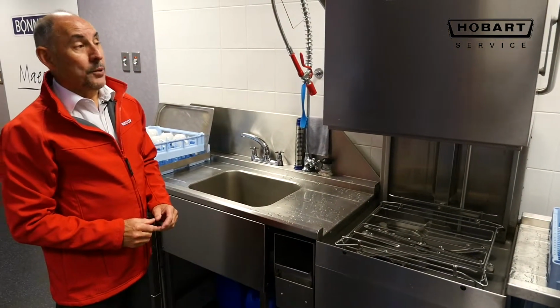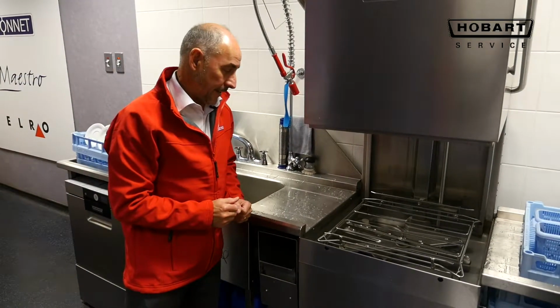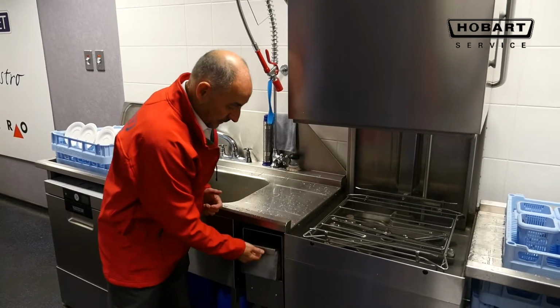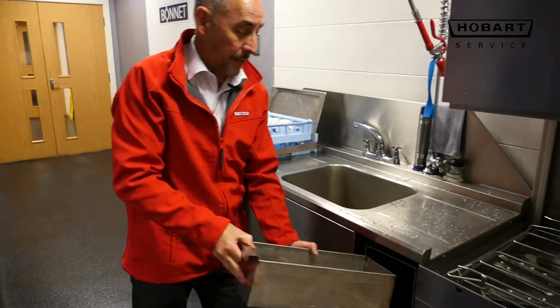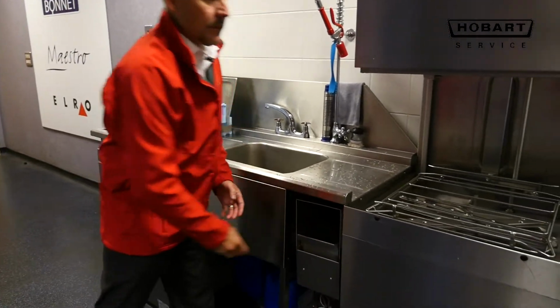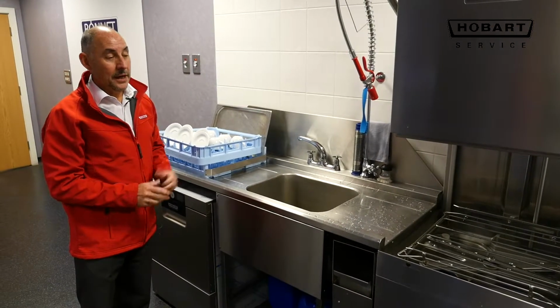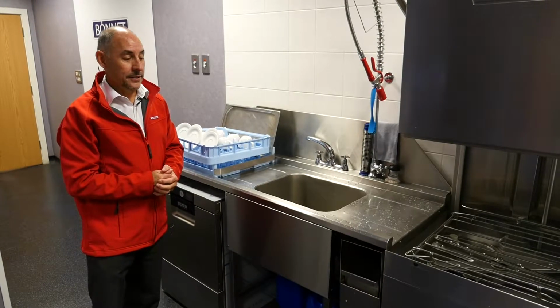Leave the hood of the machine open, it'll allow it to dry, and therefore it'll save on your cleaning because none of the protein will start to grow. This at the end of the day, cleaning out every time, wash and replace. Isolate, switch off at the mains, and then it's all finished and ready for the morning.